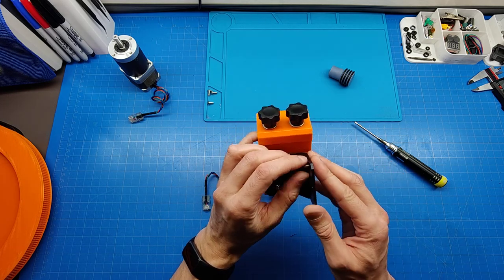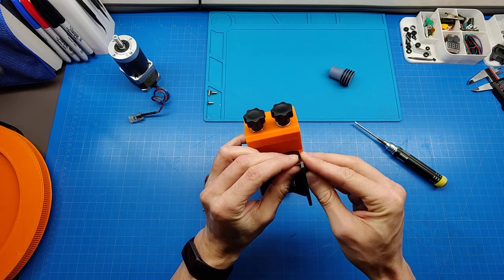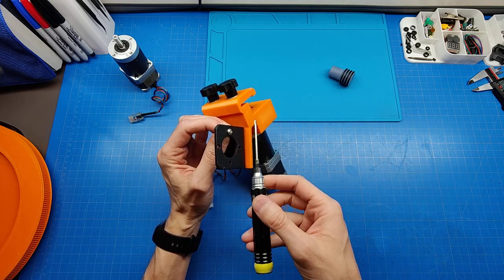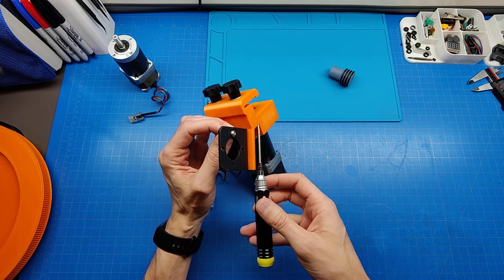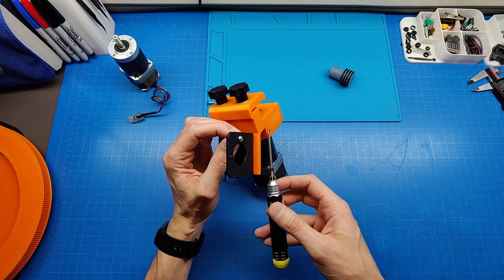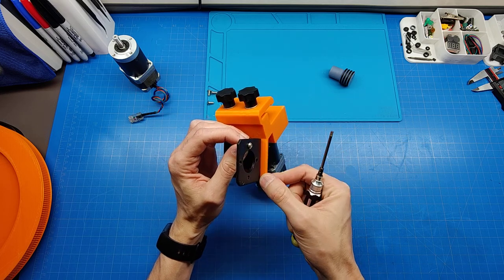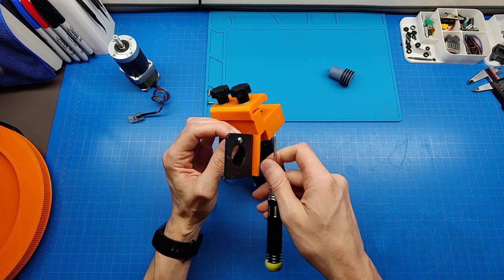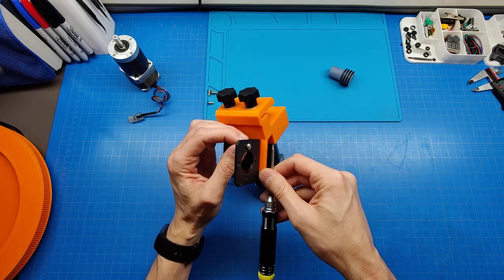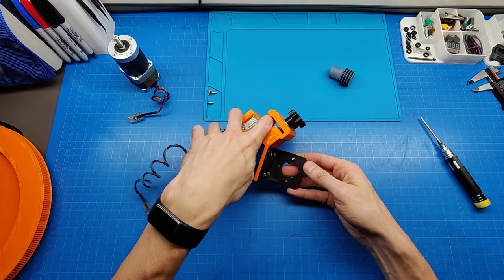the Dobsonian box. But I don't want this to be sticking out too much, because this piece is actually sort of a compliant mechanism. This wall is sort of gonna float with the inaccuracies of the curvature of the bottom base while it's rolling. So basically this wall is made so thin deliberately to work like a suspension for the azimuth motor against the circumference of the bottom base of the Dobsonian mount.